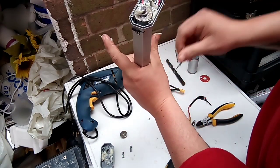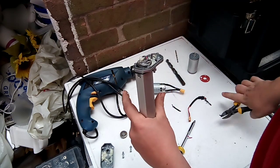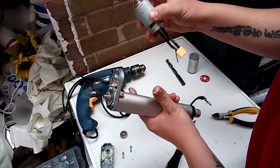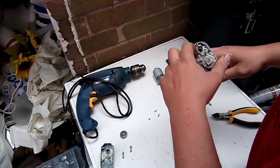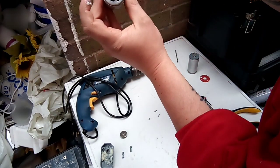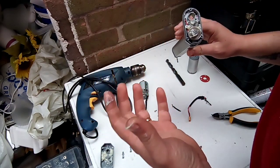Back to this — just pull out all the mess, all the wiring, whatever the hell that was. So obviously that motor needs to fit there, but it's not quite big enough — because that is a 12mm hole and that is a 13mm whatever the hell that bit is. That's where the drill bit comes in. The other bits to drill are the two holes — that hole there and that hole there. They almost perfectly line up with your two mounting holes on that, but not quite. Hence the 4mm drill bit — you just want to go through those and make sure they line up.